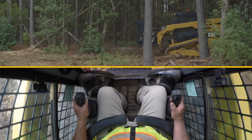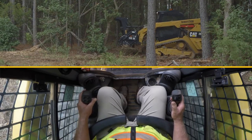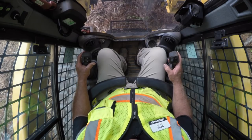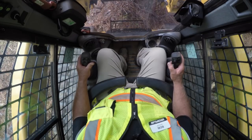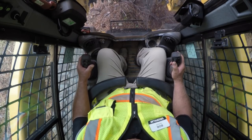Caterpillar recommends cutting trees eight inches or less and leaving the torque tube of the machine in a position so that once the tree is cut, none of the tree portion will be coming back at the operator, so you want to have a low stump.